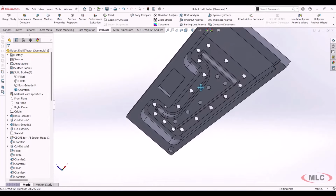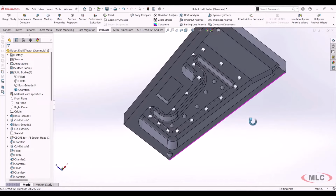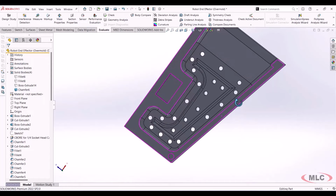One thing you'll notice, I have all these portholes. Now, I already showed you where the pour spout was. These portholes here are called vent holes. And vent holes were particularly important in this area, right in here, because you can get a lot of air bubbles trapped in here. So you need these vent holes to help purge the cavity of any air bubbles.